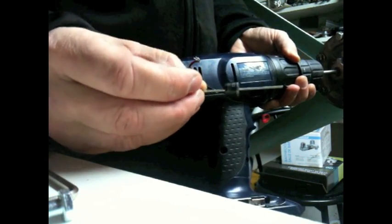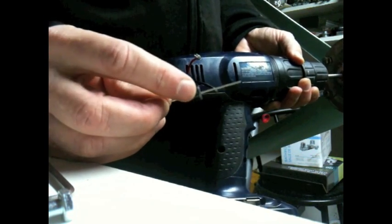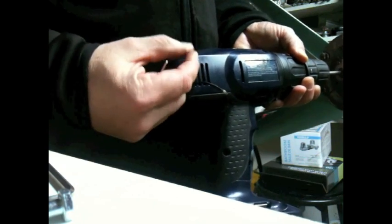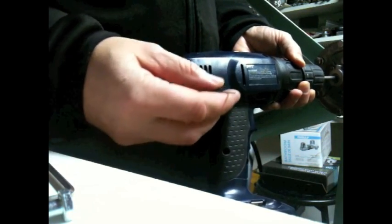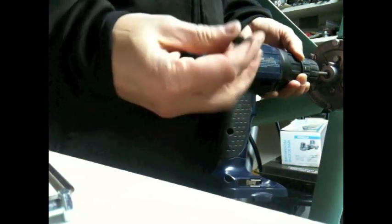I'll take a close-up of this later on. It's a little component like this — you can buy them on eBay or any electronics store. This particular one is a 6 amp blocking diode, and you put it on your positive lead, the red lead, and that goes to your battery. When you generate electricity, it only flows one way to your battery — you don't want the energy from your battery coming back and spinning the blades.